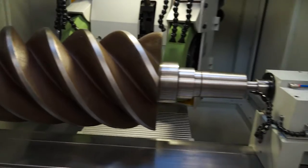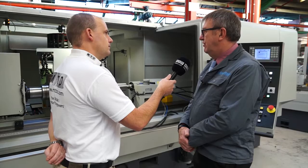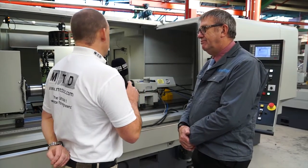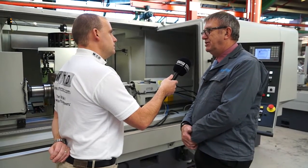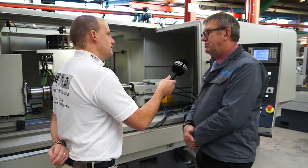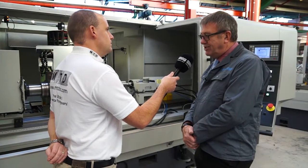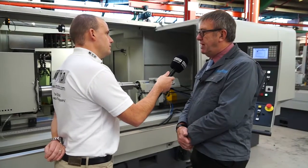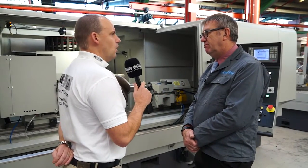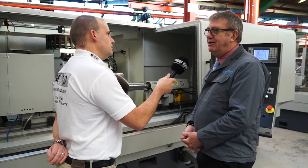And what would be cycle time for grinding both ends of this part? To grind all of that, you'd be somewhere in the region of 25 to 30 minutes. And would you have to redress the wheels during that? You would — there's a lot of material to come off, so it does need to keep the wheels sharp. We have diamond dressing positions where we can dress both of the grinding wheels. You would be dressing every diameter at least. How long does it take to dress? About 30 to 40 seconds — it's not a long process. The beauty of the machine is it's all automatic, so the operator doesn't have to do anything.